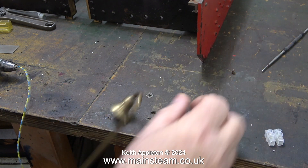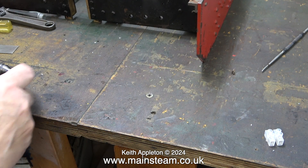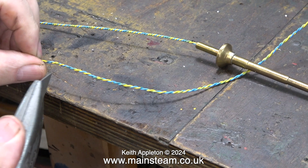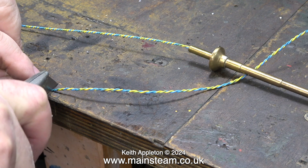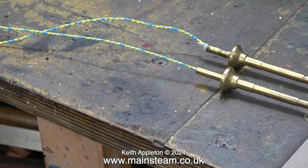Don't do it this way - a small mini drill is far too fast for this job. Normally I would use a larger electric drill that runs far slower. Anyway, at least the wires are twisted together. I'm not actually going to use this wiring for the finished job because it is solid core wire, and there's a high probability that it could fracture quite easily.